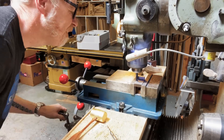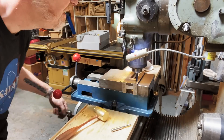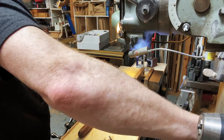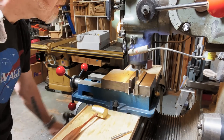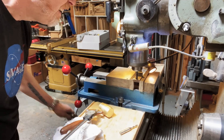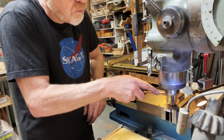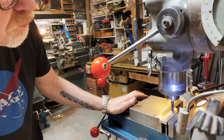This L-shaped piece that's in the vise right now will eventually be the main body of my vise. It is very satisfying work to take a piece that was not square and make it square. Especially since I have also just recently trammed in my mill very tightly, which means that when you do multiple passes like this you can't feel the difference between any of the passes. The mill is tuned to less than a thousandth of an inch across the width of the vise jaws — it's a very precise machine now. I'm very proud of it.